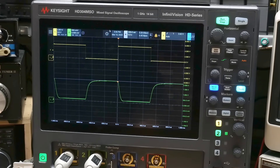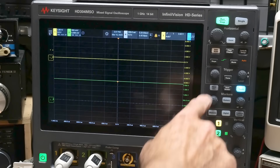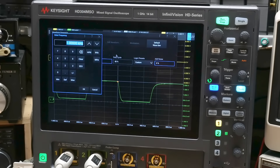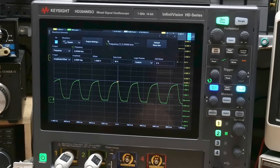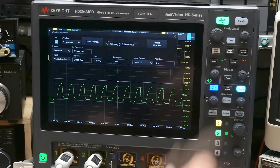The turn-on time is a little slower because you have to overdrive that 10K, but overall I like this waveform better. Now it won't go terribly fast — going to the wave generator and turning up the frequency, it's cruding out at about 3 kilohertz. Even without the pull-down it only reaches about 5 kilohertz, so this is a very slow part.